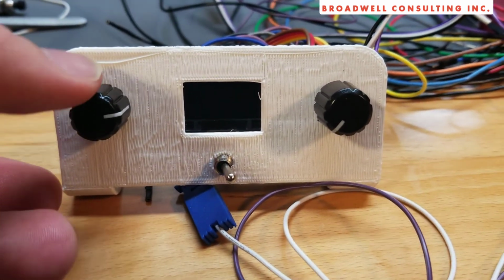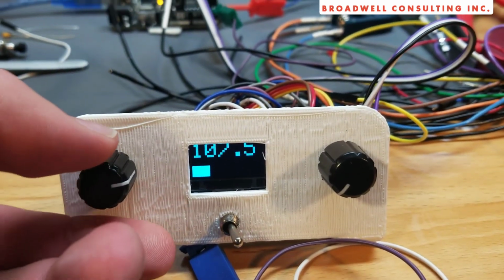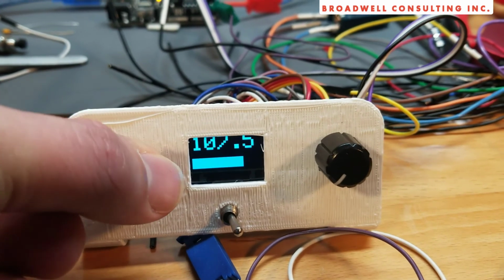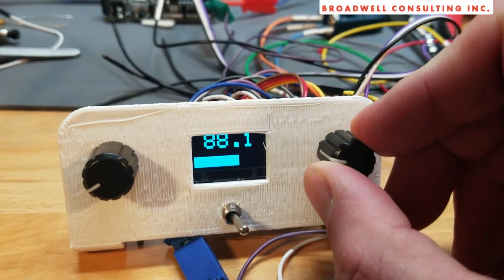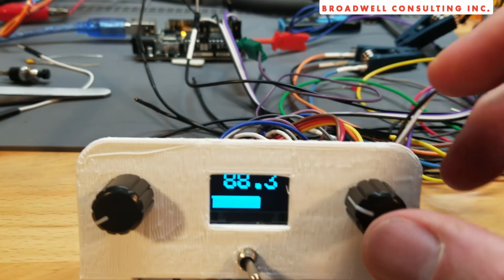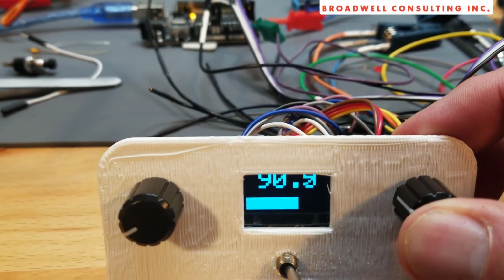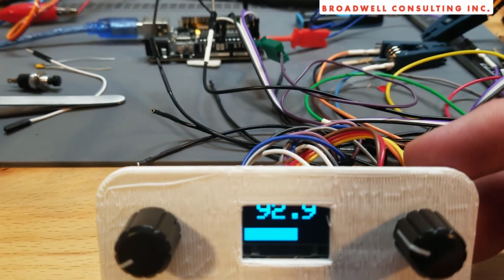In a future video, we're going to show how to use two Serial Wombats together with an I2C display to create a front panel. The advantage to this is, well, that the two quadrature encoders, the screen, two buttons, and a switch would take about a dozen wires going back to your Arduino. By using a couple of locally located Serial Wombats, you can limit it to just power, ground, and the two I2C lines. Look for this in the future.